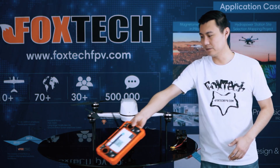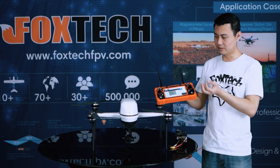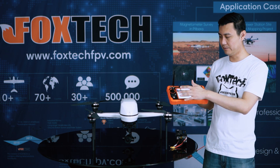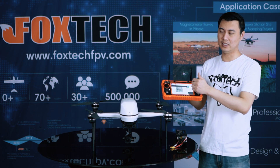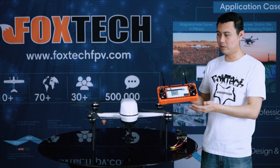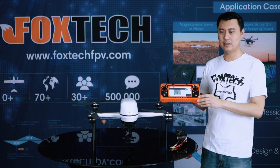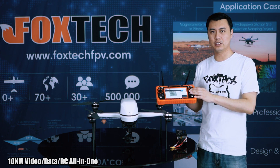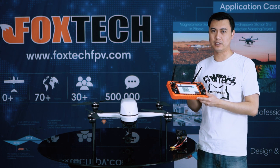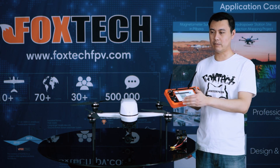To make it easy to use, we use the MX-16 multi-function remote controller ground station. You can see it's running QGC — a ground control software — where you can see the live image and control all functions, including auto-fly or waypoint navigation just by touching the map on the screen. The MX-16 has a video and data range that can reach over 10 kilometers.